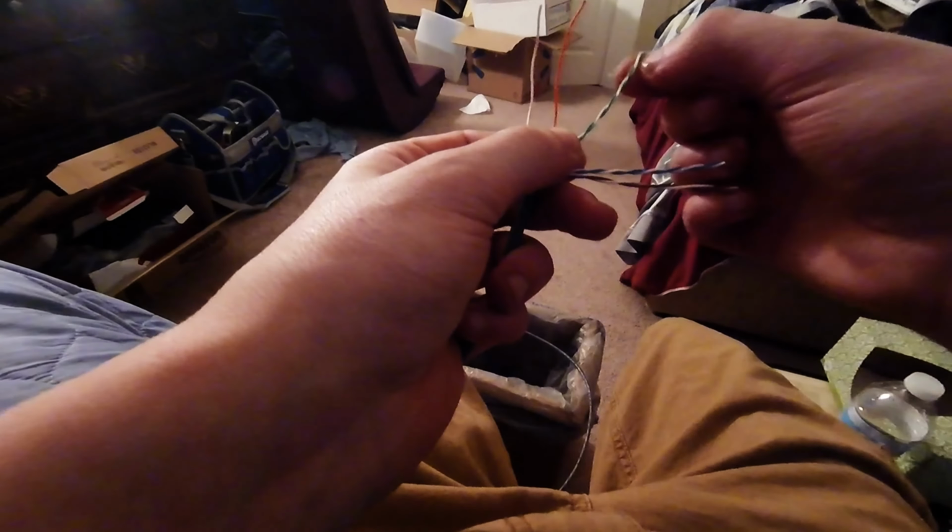So you're going to want to untangle the wires. I usually just do one group at a time, and it will be white, orange, orange, and then you're going to take your green, and it's always striped, solid, striped, solid, striped, solid, striped, solid. There's never a solid next to each other or a stripe next to each other. So it's white orange, orange, white green. Take the solid green, just bend that out of the way, and it helps to go like this to the cables after you do each one. Then white green, so then it will be solid blue, white blue, solid green, and you guessed it, white brown, brown.